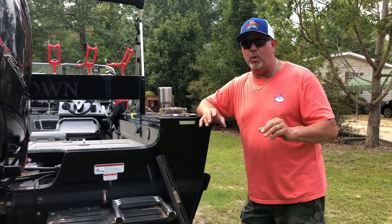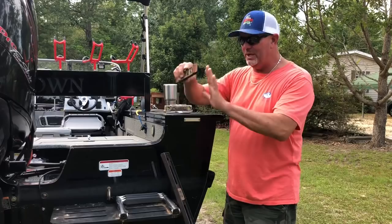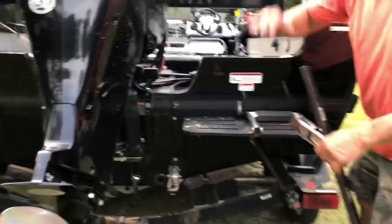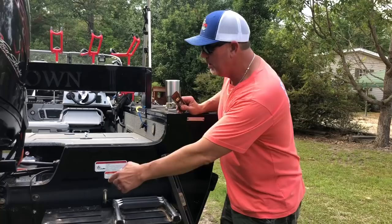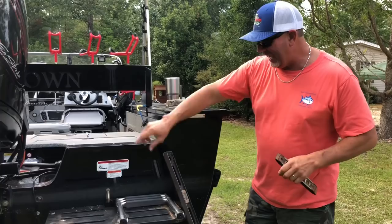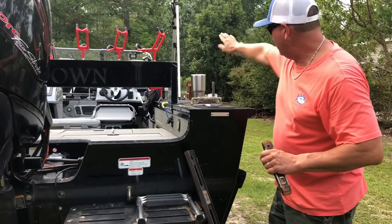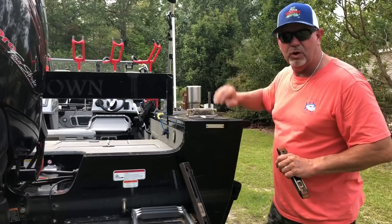You may get into a place with real clear water or a place with muddy water — just adjust accordingly. But first and foremost, make sure your transducer is set up level when it's sitting in the water — level side to side and level according to how your boat sits in the water. When you run your transducer cable up to your boat, please make sure you do not get any kinks in that cable. I don't know exactly what's inside it, but I figured it's something like a coax cable. You don't want it to break, so make sure it flows real good up through the bow or wherever you run it, back to your electronics.